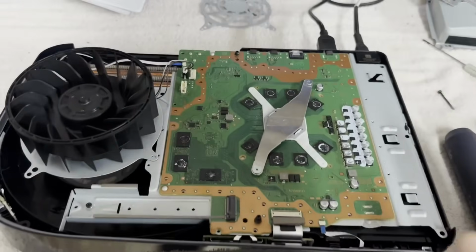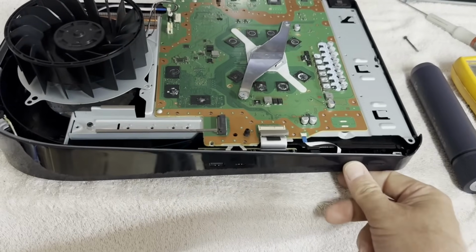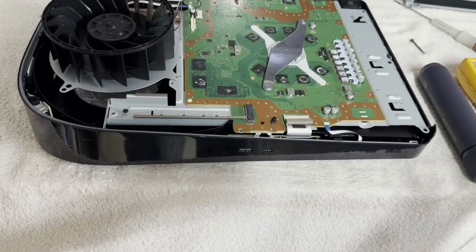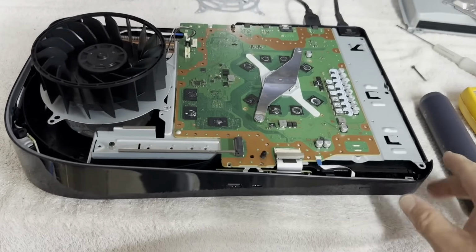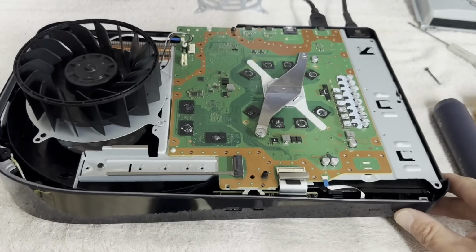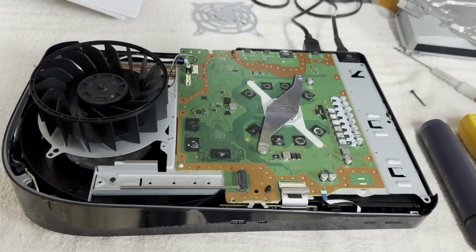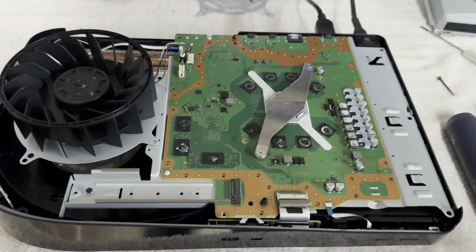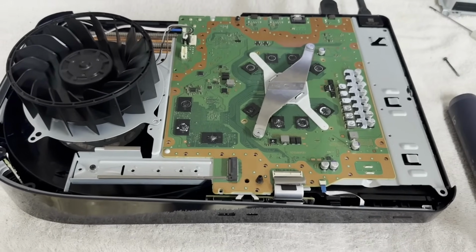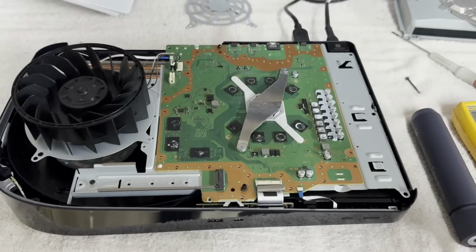Well, my known good power supply is installed. She's put together enough. The APU clamp is on. We have power? No. There's no drive installed. So that's why the eject didn't beep. But the power button does beep. But we get no lights. So yeah. We have a dead main board and a dead power supply. Okay. Well, it is what it is. We'll get the board back out and take it inside. See if we can fix this and the power supply.